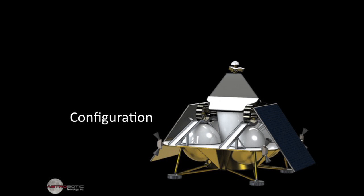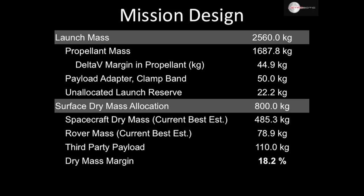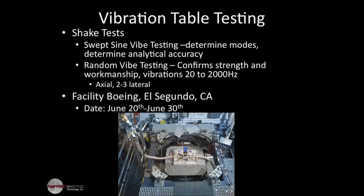I'm going to give a quick overview of the lander configuration — why we look the way we look — moving on to slide 13. When we configured this spacecraft, we configured it around structural requirements. It's a 2,500-kilogram craft. The structure must support that mass during launch, cruise, and landing. Surviving launch means being very stiff. We have to maintain minimum natural frequencies that preclude coupling of our spacecraft shaking with the Falcon 9. It also means surviving random vibration, which creates stress on the structure. The facility we're intending is Boeing Satellite Test Facility in El Segundo. This will be done on shake tables and includes modal surveys, which will compare with our analysis model and tell us if the natural frequencies from the test match what we expected from analysis. It'll also do random vibration tests to ensure we'll survive launch, and it ensures that workmanship is good — for example, if there's a weld that's not very good, you might notice failures there.